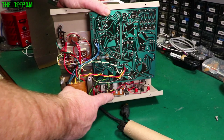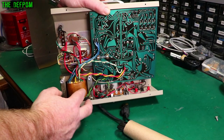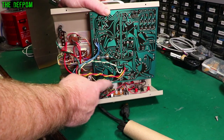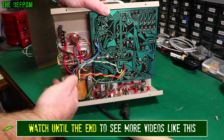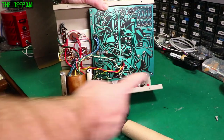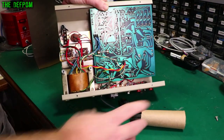This transformer has got two windings which can be put in series. The windings are 120 volts so they're currently in parallel. What we'll have to do is rewire these four wires — take two off, one from each side — and join them together in the correct sequence to put them in series to make it 240 volts. You have to make sure you use the correct sequence so the transformer windings don't end up fighting each other due to a phase problem.